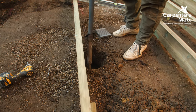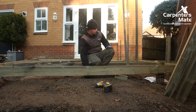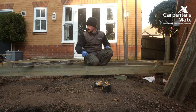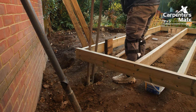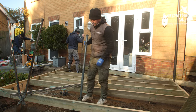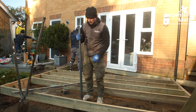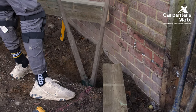We're now getting our main posts in — we dig to the correct depth and backfill with concrete or postcrete to make it quicker. We pull our levels in, put the main posts in, and then afterwards we can add more posts throughout for extra strength. When the ground is nice and soft we aim to get the posts in about 600mm. When it's rock hard we go down to what feels suitable, but anything over 450mm is usually fine.